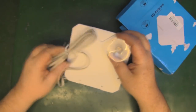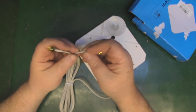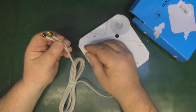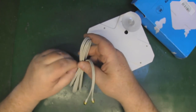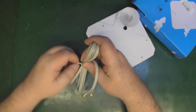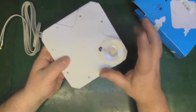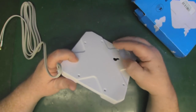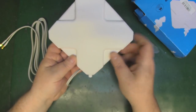Let's take it out of the box. We've got some coax that looks a little different from the coax on the previous antenna — maybe a little bit better. You get quite a long length and two SMA connectors going into one antenna, which is never a good idea. You really want to purchase two antennas and experiment with the distances. There's a suction cup on here that rattles around a little, with threads so you can orient it like a diamond shape.